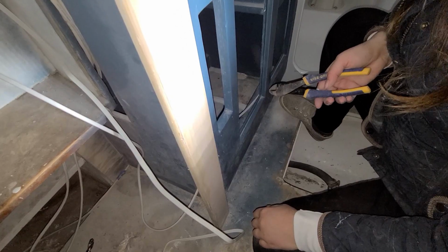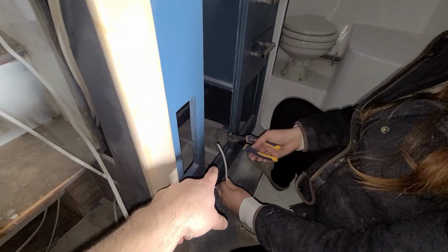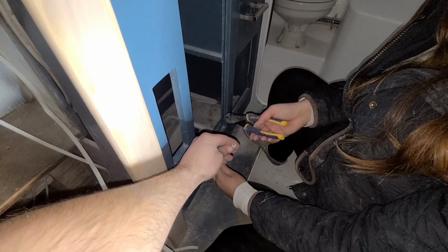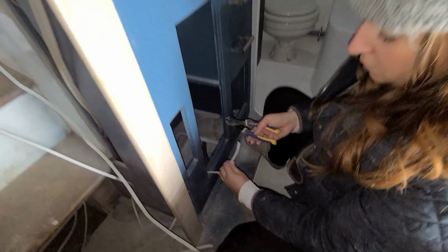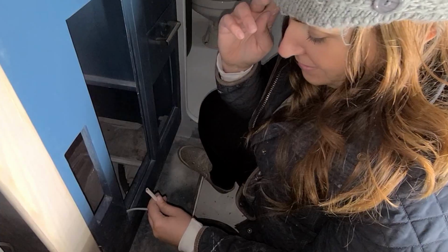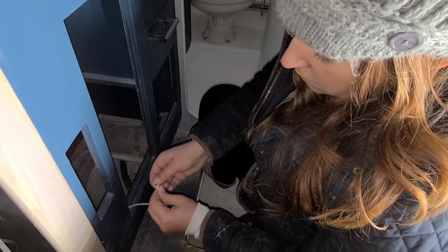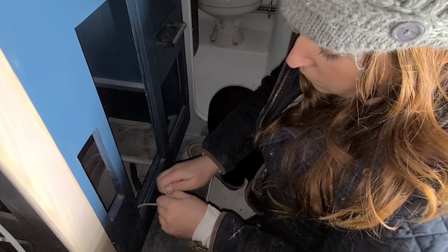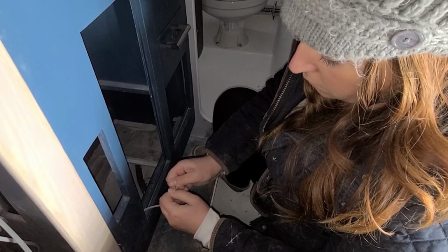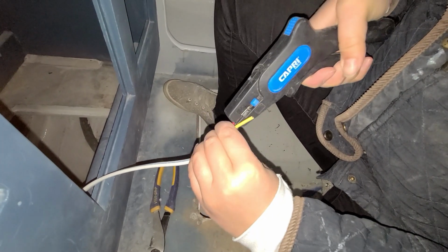Good. So pull the wire out of there. And then carefully, so as not to cut the two wires in here, snip down the middle, right between them. Now you grab the two wires. You can peel that back a little bit, as much as you need to. Then you muscle them apart so you get about 2 inches of exposed yellow and red, ketchup and mustard. That's probably good right there.